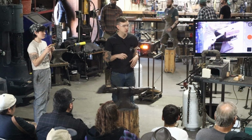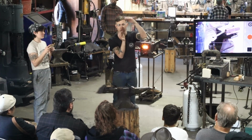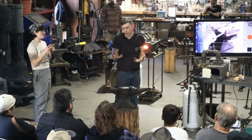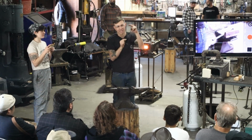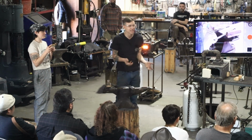Generally, when you have a square end, it's easy for that to become a fish mouth. The points of the square end tend to curl over unless you control that. Now, the wider your stock, say you're starting with 1/4 inch or thicker, the more likely it is to just become a point. But when it's thin stock, it does really weird stuff. And we tend to like to start with stock that's pretty close to what the thing is that we make.